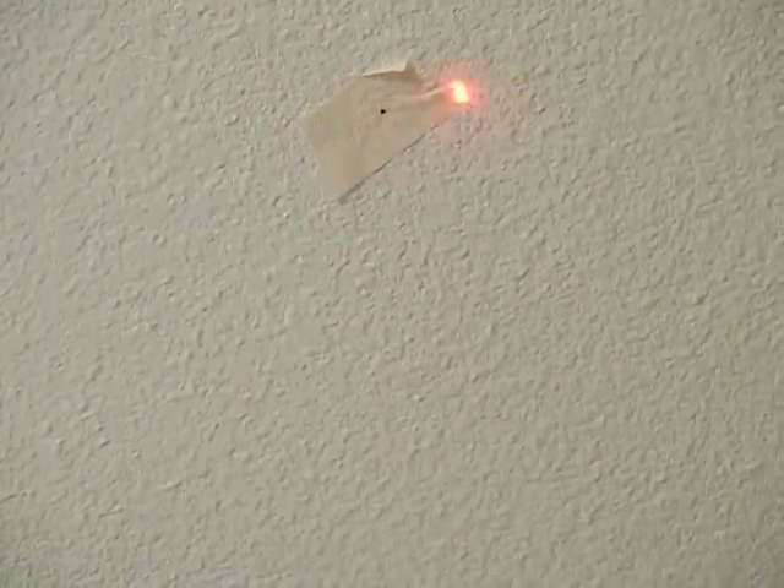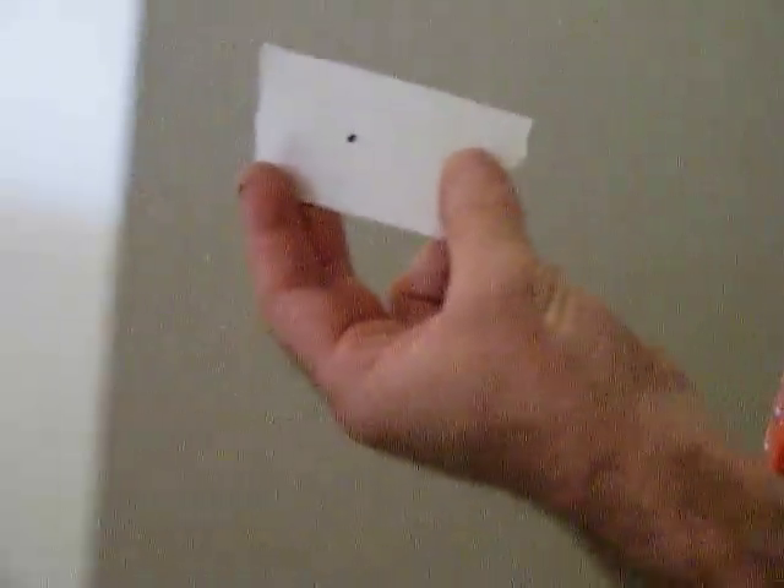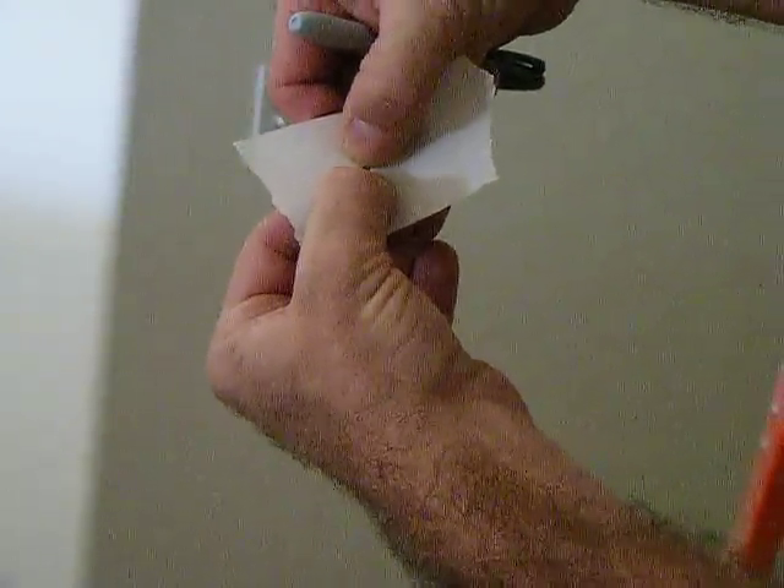Turn the laser 180 degrees. Back to the ceiling one more time — check the dot. As I had suspected, I wasn't so accurate the first time, because this example gives me a whole lot better mark than what I had seen the first time. As you can see, I'm well within tolerance. The distance would actually only end up being half of what you see between these two dots — so again that eighth of an inch, and then half that, a sixteenth of an inch over eleven feet.